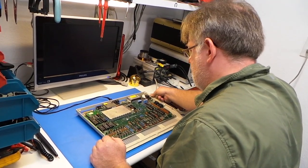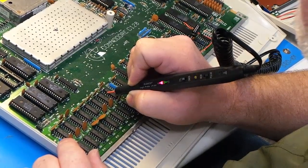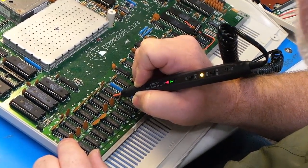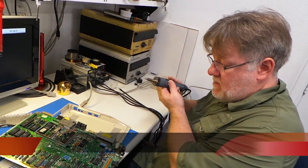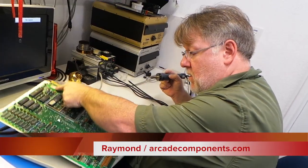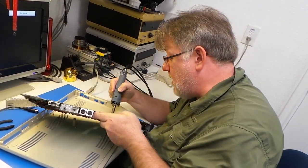Raymond must really be a Jedi Master because it actually gave him a display even though it was garbled. He got to work using some of his magic tools. The data bus is not coming up properly — data bus line D3 is just all garbled. So we're going to take out the CPU and check that out.